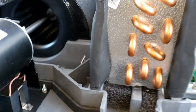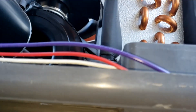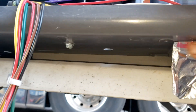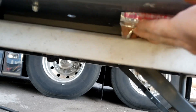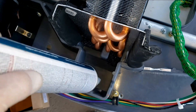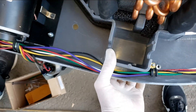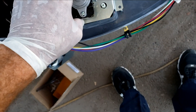Here's my high-tech plan: I'm gonna get some metal tape and plug off the holes right there - you can see the weep holes right there. That alone isn't gonna be enough, but let that be plugged off. Now I can get some Pro Flex, fill those holes and massage it into place - that should do a pretty good job clogging the holes. Just like that, those holes are sealed, and Pro Flex is waterproof.